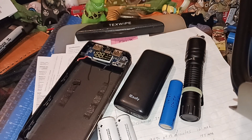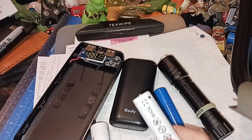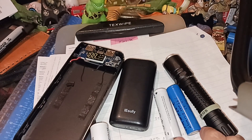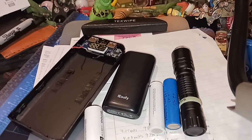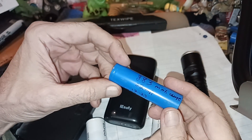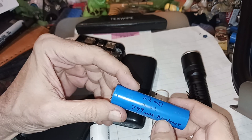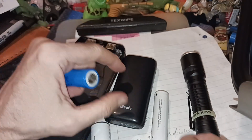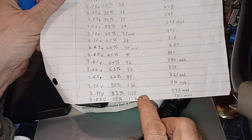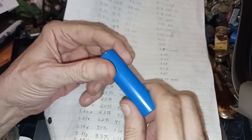I hope that helps explain what you're looking for in batteries. If you grab these cheap cells expecting high performance, you've got a smaller gas tank and you can't hot-rod it — you just have to poke along. These are not totally useless as long as you know their limitations. They'd work fine in a small light or something like that. Just remember if there's voltage protection, it'll shut off at three volts, so your usable capacity will be somewhere between 750 and 600 milliamps.